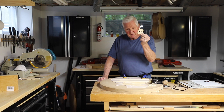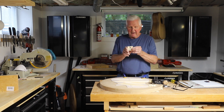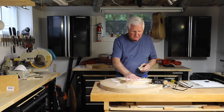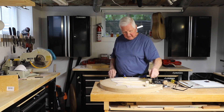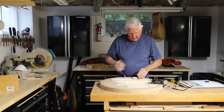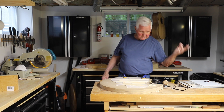This is another little jig — this one tells me how far to cut down here. When you see it rocking back and forth, it means I haven't taken it down far enough. I've taken the router and lowered the bit 60 thousandths of an inch and cut this piece out on both sides. I want the edge to be 60 thousandths of an inch because that's how far it's going to embed into the side of the guitar, and we can glue it like so. Down in the corner where the pieces come across at an angle, I nipped off the corners so I can get in there and make sure it fits. It's just a piece of plywood and it's a very easy jig to make.